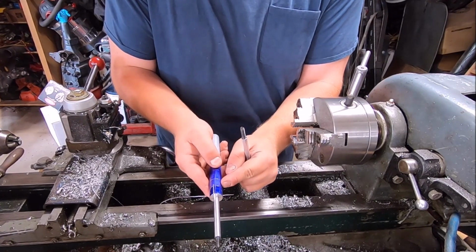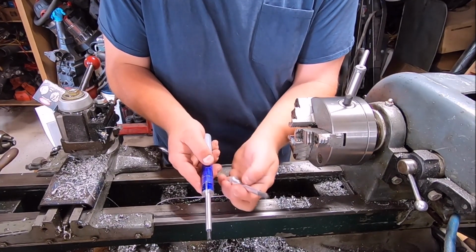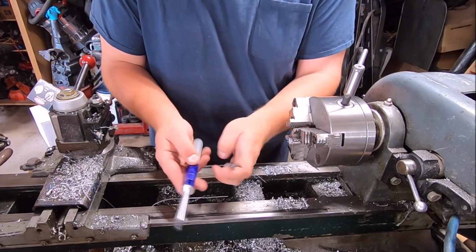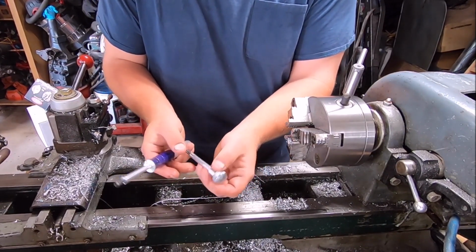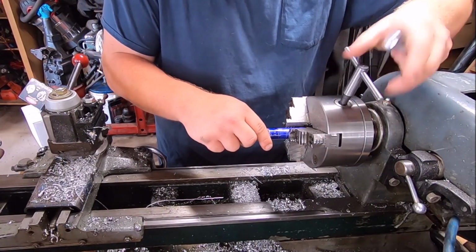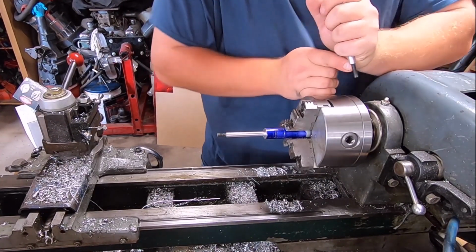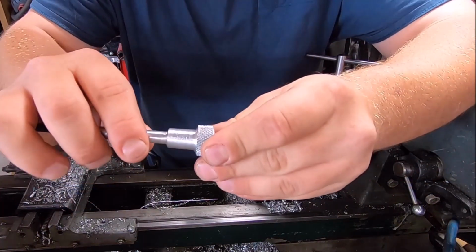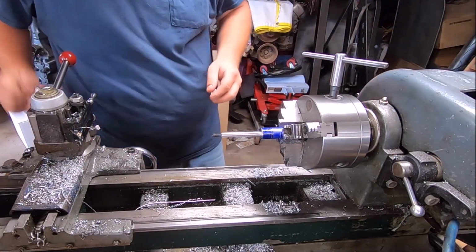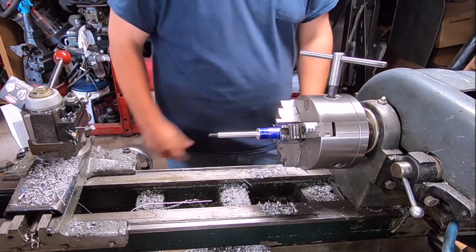This middle part right here will be the knurling, which you see there. And then this line down will become the shoulder, which is right here. So that's what we're gonna do now. The knurling is the last piece we do because we can't clamp down on the knurling since it's aluminum, it'll crush it. So we're gonna set this up in the lathe. We're gonna machine that part down to the right diameter, run some measurements, make sure it's all good. And you also notice on this piece, it does bevel upwards. Hence why we're using this cutter, because it allows us to do that. So, music back on, speedy footage for you, let's rock and roll.